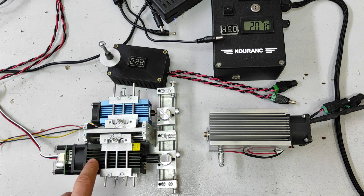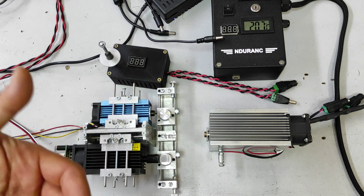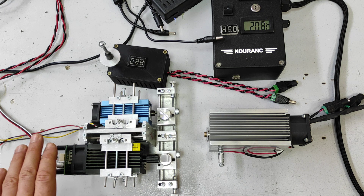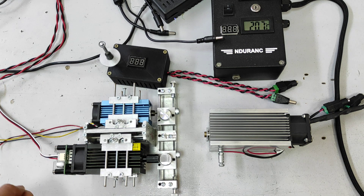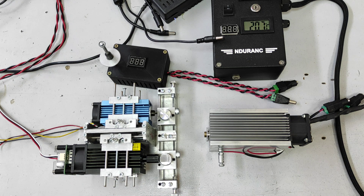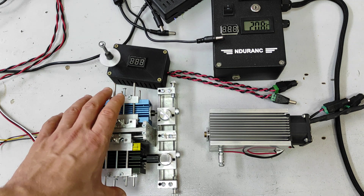The problem with this system is that if the temperature in your lab, office, or garage is more than 30 Celsius — that's closer to 90 Fahrenheit — it can really damage or reduce the lifetime of your lasers. And if it's even more, like 35 Celsius, closer to 100 Fahrenheit, that can definitely decrease the lifetime of your lasers significantly.